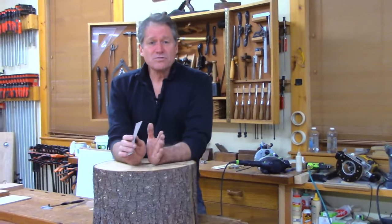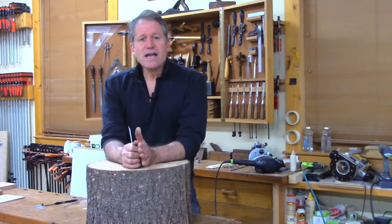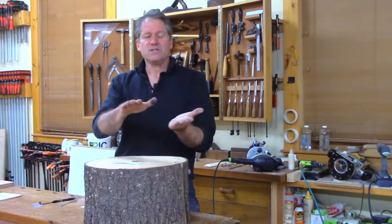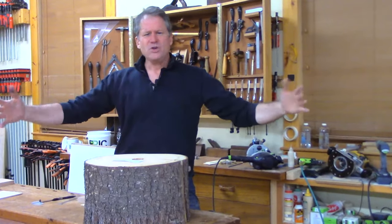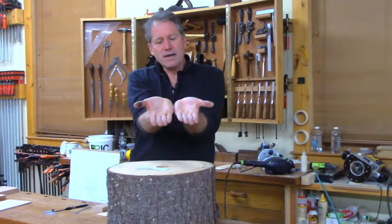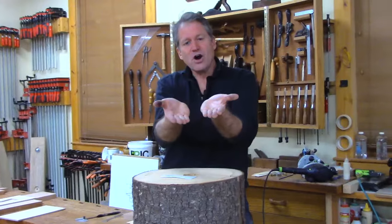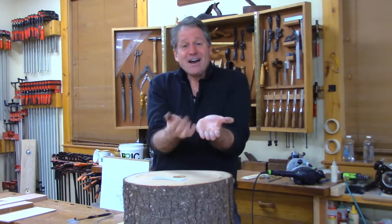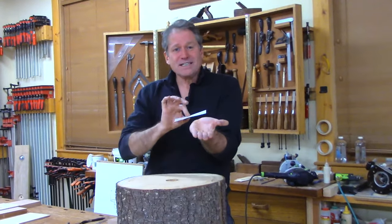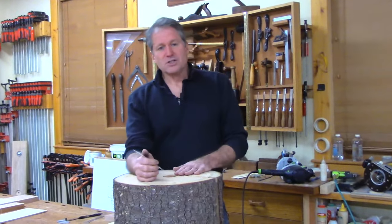he was famous. Probably his most famous pieces are these grand peace tables. He would take two consecutive, magnificent slabs of walnut that were huge and book match them, so you had a mirror image. Usually you had a little curvature or a hollow in the middle, and he would take that opportunity to put these butterfly bridges across there to reinforce and decorate. They were quite often a contrasting wood, a dark ebony, so that they would really show as a decorative detail while being a strengthener.